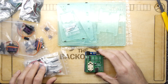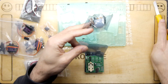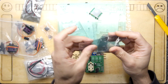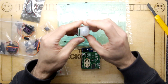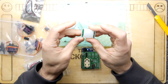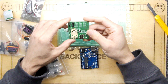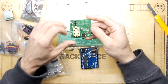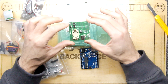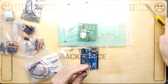We've got servo Z, servo L, servo R — so it's going to work in the same way as those 3D printers, like the Anycubic Kossel printer I have which uses three arms. It's basically using inverse kinematics to power the end effectors — that's the maths required to figure out where everything needs to be in the XYZ plane. It's also got an actual PIR sensor; I wonder if that's to make it only operate when you're near. M+ and M- is probably for the laser.